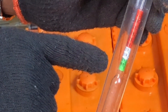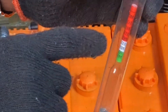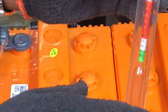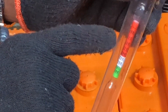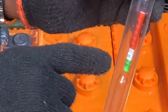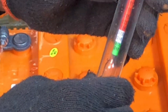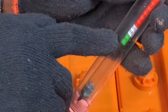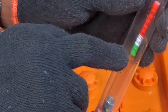The highest value on the scale is 1300 while the lowest is 1100. When your battery electrolyte is close to 1100, the efficacy of that electrolyte is totally gone — you either go for external charging or replace the electrolyte entirely. If it's between 1150 and 1200, recharging can bring it back up to around 1280 or 1290. For the electrolyte to be good and not damage the battery cells, it should read between 1275 and 1280.